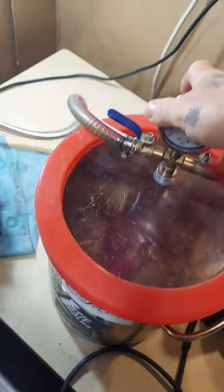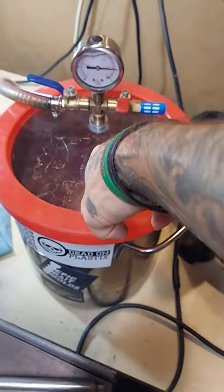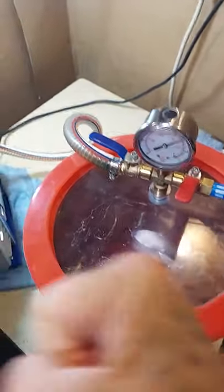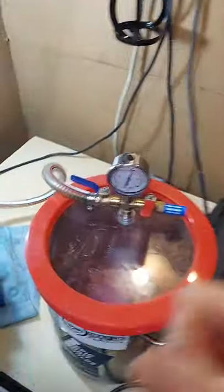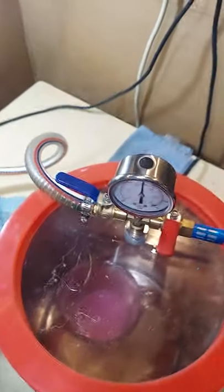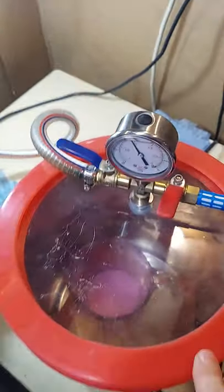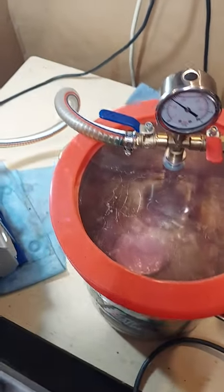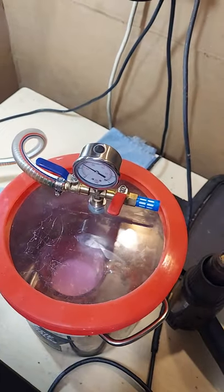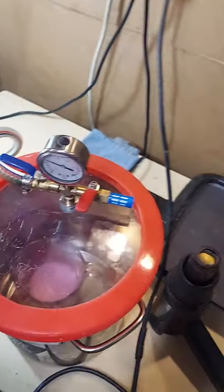Our belly just came out of the microwave. I stirred it up a lot — I've got flake in there, so I really want to make sure it's all together. After I degas it, I don't stir it with the knife anymore, I swirl it with the cup. That way you get your glitter back up to the top — it wants to sink in the hot plastic. So you're pouring somewhat consistently as far as where your glitter is.